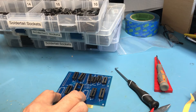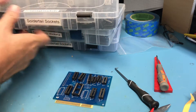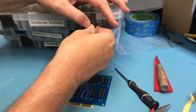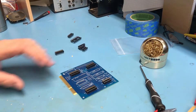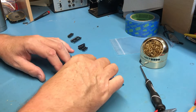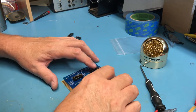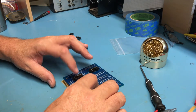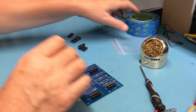It'll also need two DIP switches which I will put in later. So I think that gets us through sockets. On to a bit of soldering — get a socket in each one of the four corners, making sure the notches are consistently in the correct orientation.